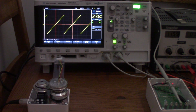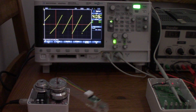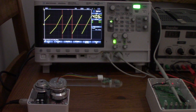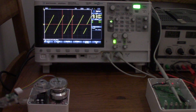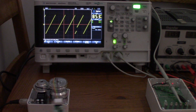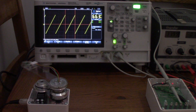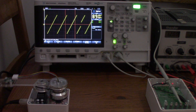I'm changing the offset to 50 and leaving it running for a few cycles. We've now got 478 millihertz — let's see how stable that is. It's reading 481, so it's around about 480 millihertz at offset 50.